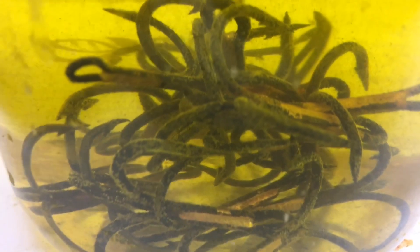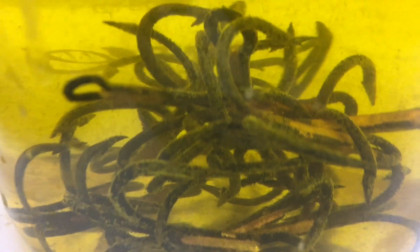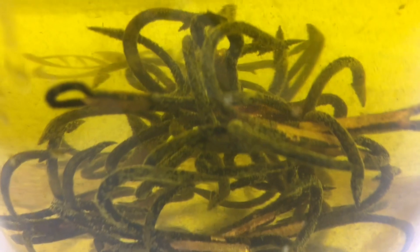They're all in there now and we're dissolving all the rust. Here you can see all the bubbles that are forming — that's hydrogen gas. When the acid hits the iron, hydrogen gas is formed. At the same time, the rust goes into solution and the solution becomes green.